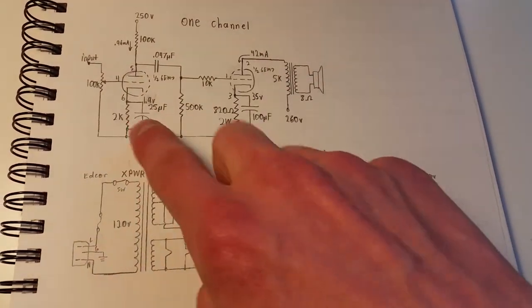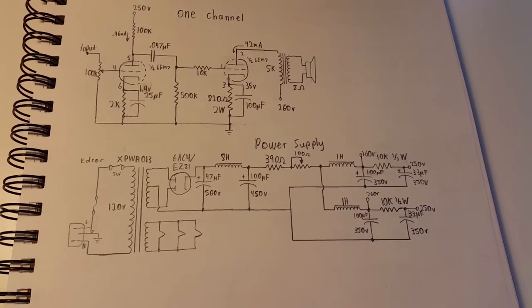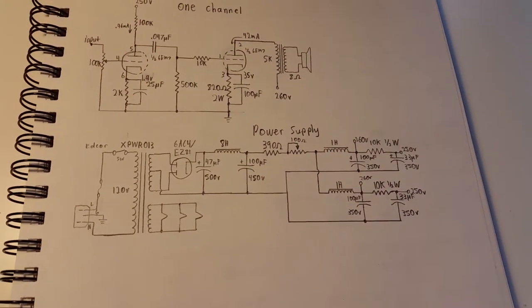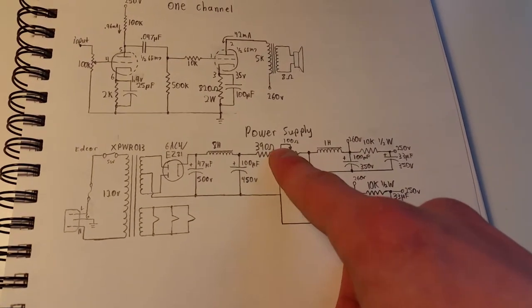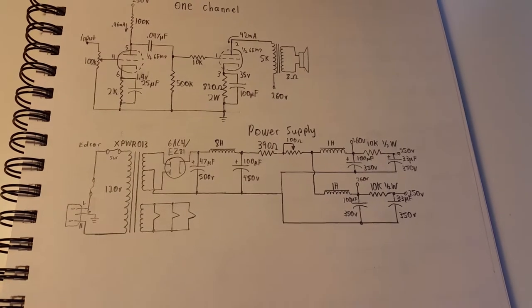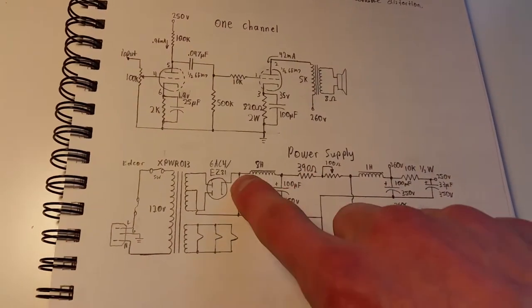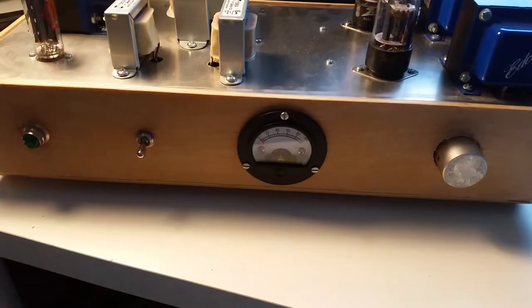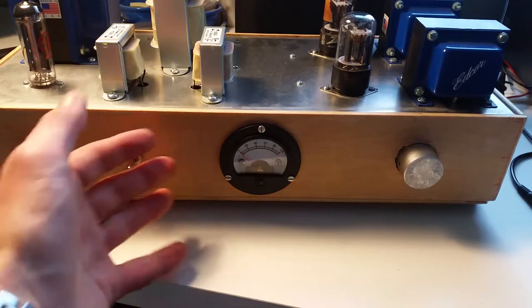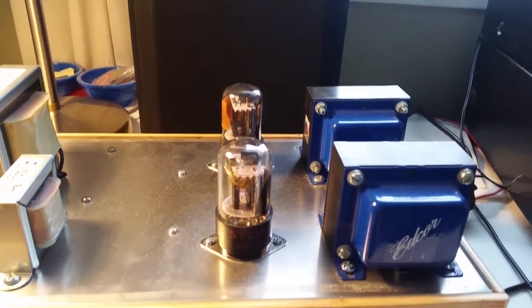The schematic is literally just two triodes — a gain stage and a power amp stage — with a 5K to 8 ohm output transformer. These are Edcore transformers. For the power supply, the original design used an 8 henry choke with some specified resistance to trim the voltage. I omitted that and used a 10 henry choke with slightly higher resistance, so the supply voltage is probably a hair lower than it should be. I also added a high-tension current meter somewhere after the rectifier — it was partly aesthetic but proved very useful.